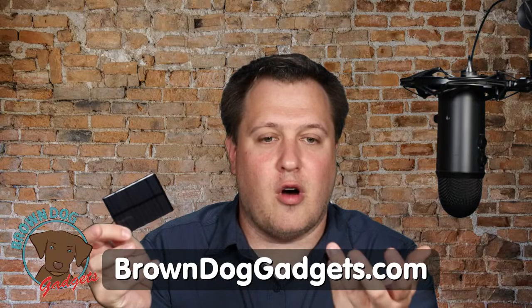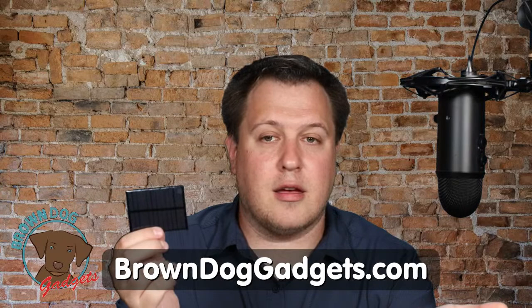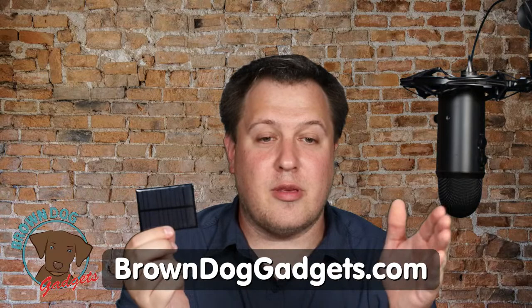So I always tell people, if you want to build bigger solar panels for especially USB charging or stuff like that, you're just better off buying a cheap commercial folding solar panel because it would save you so much money, give you a lot more output. And you always want more solar energy than you think. The rule for solar panels is you want 1.5 times the power you actually need. So if you need 10 amps of power, you want to build a system that's 15 amps.